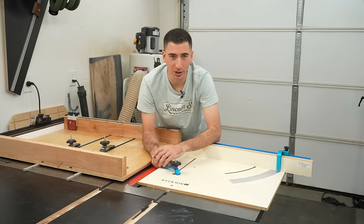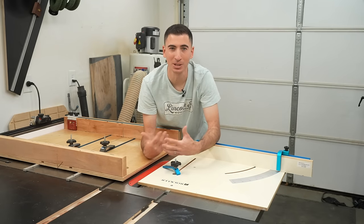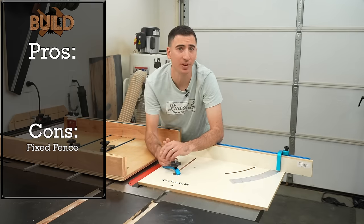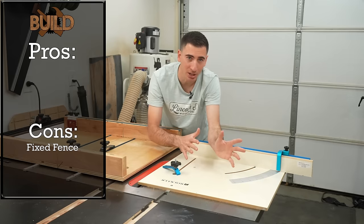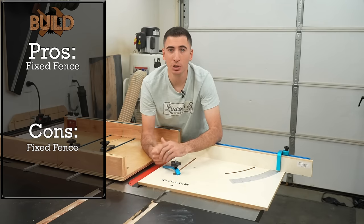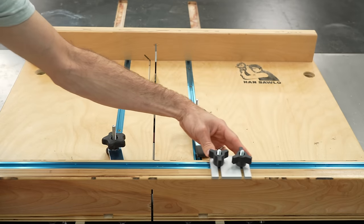If you want to build your own crosscut sled, there are hundreds — likely thousands — of videos online, but at the end of the day they're all some version of a piece of plywood attached to runners that go in your miter slot, with a fence perfectly aligned to give you 90-degree cuts. The main disadvantage is that your fence is fixed in place, so it's not ideal if you cut a lot of small angled pieces. But that con becomes a pro because once you get it dead-nut square, it's not moving. You can customize the sled to your exact size, add hold-downs, T-track for stop blocks — the list goes on.